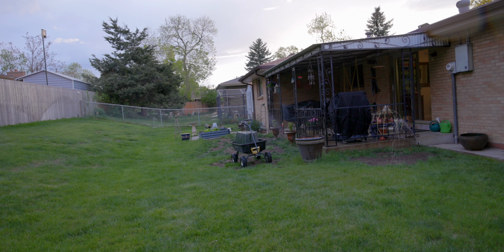Yeah, okay, so other than this one right here, Zone 5 looks to be in pretty good shape. Again, we'll be revisiting this one later this summer to see what's wrong with it, and I'm also probably just gonna flush this entire line out because this is the lowest point in the line. So obviously at some point something got into it, and maybe the last time I flushed it, it didn't get it all out. It just got it out enough to work for a year. And I don't know, maybe when I winterized it, it pushed the rest of whatever's in the line down to this head. But as you can see, again, that's really not gonna do much. That needs fixing for sure. But we're gonna go ahead and move on to Zone 6.